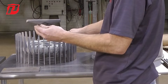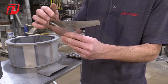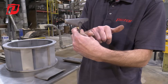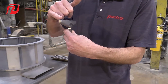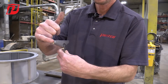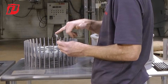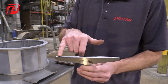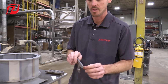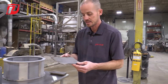How this would be installed — if you're looking at one of our fine grinder rotors, the blade would be inserted into the slot, facing up this way. This most likely would be the leading edge depending on the rotation direction. When you're doing your simple inspections on the inside components and you start to see rounding or any type of inconsistencies in any part of the blade, it's a good practice to take those out and replace them with a brand new set of blades.